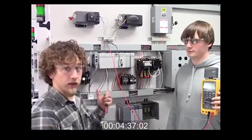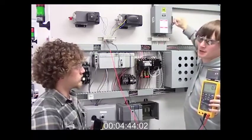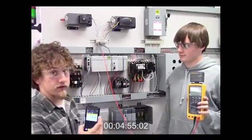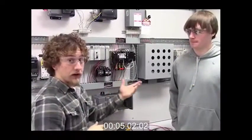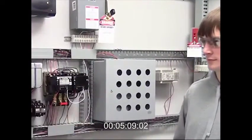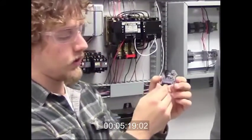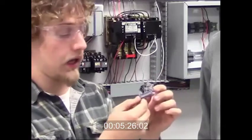So now we're going to check our power going into the motor. I've already made my electrical connections and we followed lockout-tagout procedure, so I'm going to energize and start the motor. The motor is only reading 160 volts, which leads us to know that we have an open conductor on the L2 line. We know we have power coming out of the starter, but it's not making it to the motor. The only thing in between those two is a junction box, so we're going to go ahead and check that. I've locked out all the power already, so I'm going to open the enclosure. What it looks like is that we had a loose connection on the terminal strip, which caused the conductor to burn up and create an open. So we're going to replace this terminal block and put it back into service.